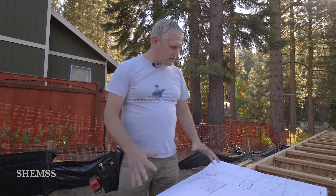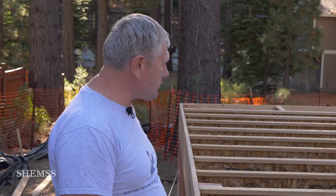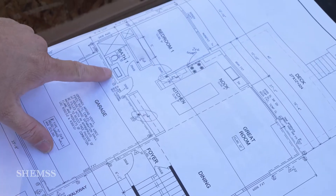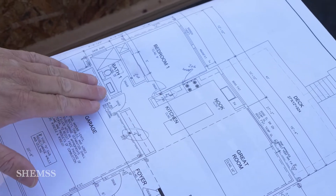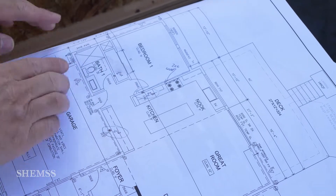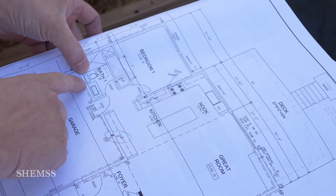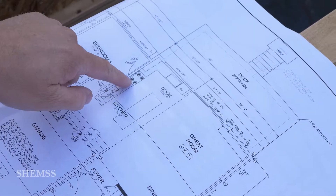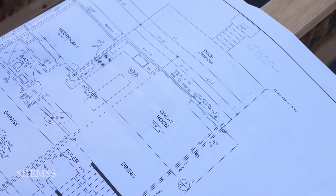First of all, we're going to check the plan and lay out the house, make sure everything — all the plumbing in the wall — checks out. We look at the first floor bathroom here, find the walls, measure everything, scale by the plan at quarter per foot: the shower, toilet and sink clearances, kitchen sink, gas stove, and bring everything up to the second floor.